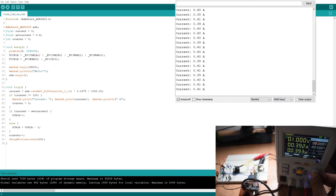I'll increase the voltage up to 10 volts. As the voltage increases, the power dissipation also increases because the current remains constant. At 10 volts I'm actually dissipating around 4 watts of power while maintaining a regulation of 400 milliamps of current.